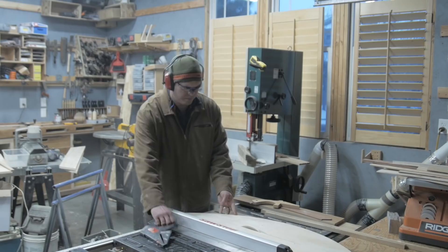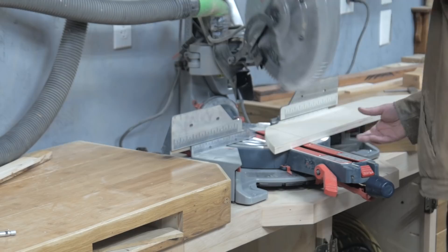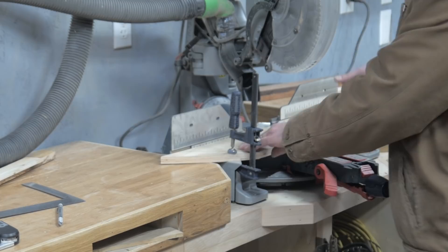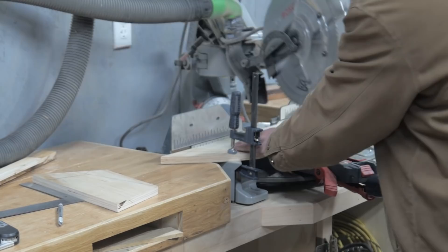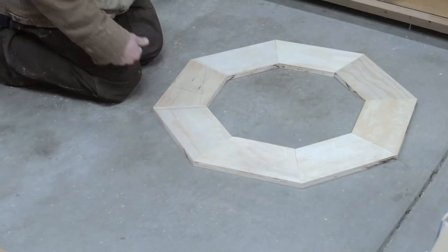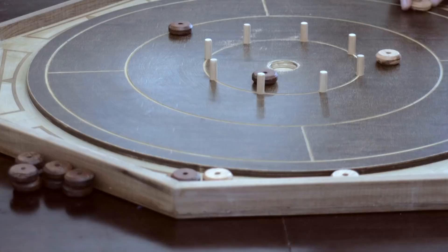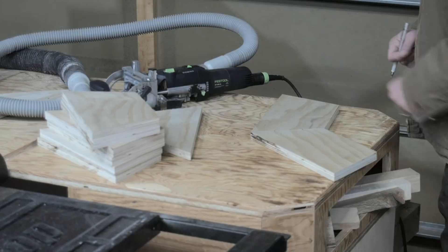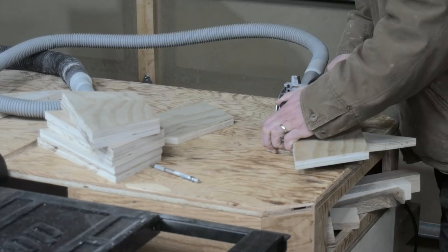The base was a nice use of some plywood offcuts, cut down to six inch widths and then cut at 22 and a half degrees at the miter saw. The long edge of these pieces was twelve and three-quarter inches. So after the first cut, I could set up an angled stop block and the rest were easy by making the first cut and then flipping the board for the next cut. A quick test of the angles and we need some joinery. I'd use dominoes to join these together, but you could easily use biscuits or even simply glue them together without any reinforcement.